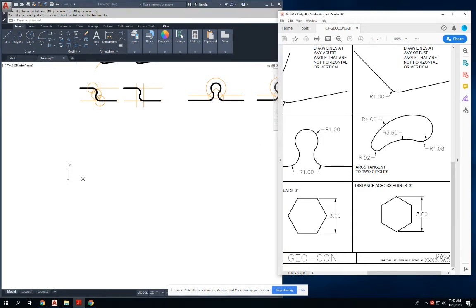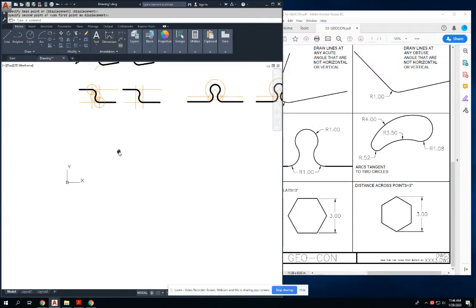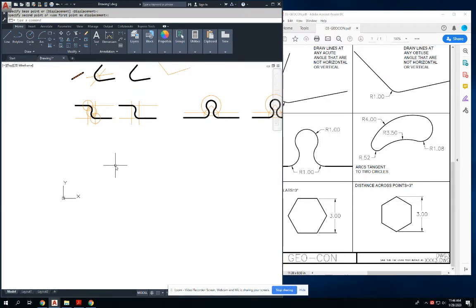So what I've been given for dimensions are all radiuses, but you were not given the distance between these two circles. So again, we're just going to have to design the position of these two circles so they're not greater than double this value, 3.5, so 7 inches away. They cannot be greater than 7 inches away. They also can't be greater than 8 inches away from outside edge. So I'm just going to kind of eyeball something and make sure that I know that it's well within those distances to get this to work.